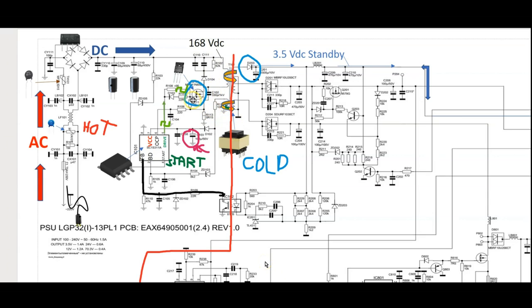We look at the gate here. It looks like a switch. And what happens is when it closes, we're taking this 168 volts to what? Ground. Right. So now it's going to start conducting. So this switch is going to keep switching back and forth, right? Several thousand times per second, thus cutting this voltage on and off through reference ground, right?